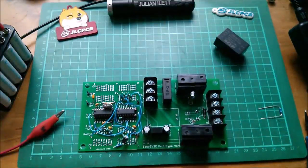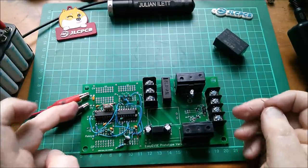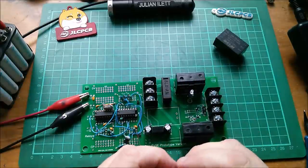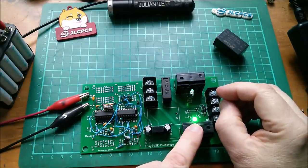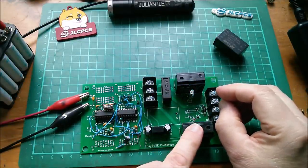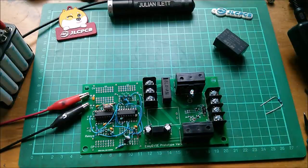The high-current tracks are now done — I've soldered thick tinned copper wire onto the traces. This is only carrying 6 amps at mains voltage, not a huge current, but I thought I'd toughen them up. Final test before fitting the 12-volt power supply just to make sure it's still behaving, since I shouldn't put 12 volts on here once the power supply is in place. Put the resistor across — looks good, so it's time to put that power supply in.